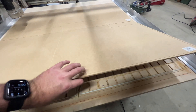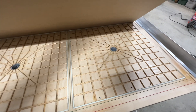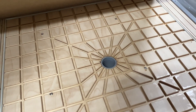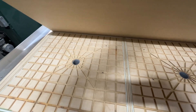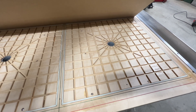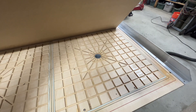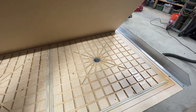All right, there's the edge quality we're getting. If you take a peek underneath here, there's two of the four grids. We've got an inch and a half PVC pipe that comes in the center of each 24-inch grid, and then there's a network of quarter-inch slots that distribute that vacuum out, and a rubber seal that goes around the perimeter, which basically creates a vacuum inside of that perimeter seal.